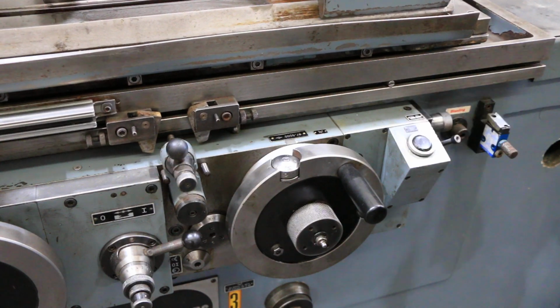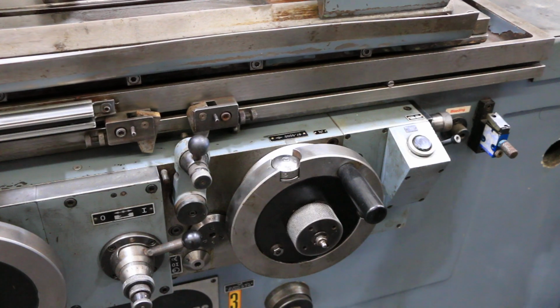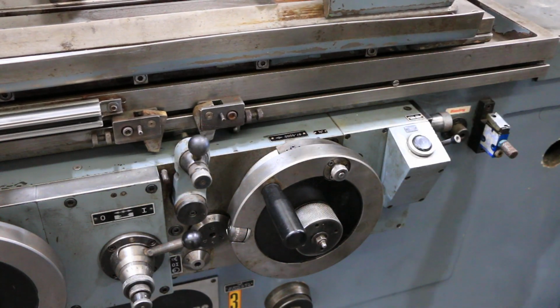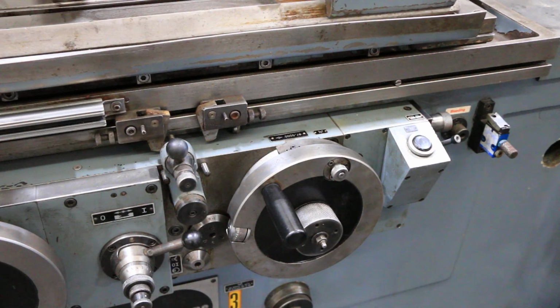So as we get down to 0, we make a limit switch inside the mechanism which starts a timing cycle, which will automatically have the machine back up here and back up the grinding wheel about 1 inch or so away from your workpiece, and the workhead comes to a stop.